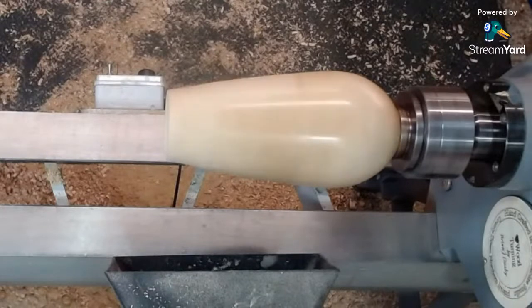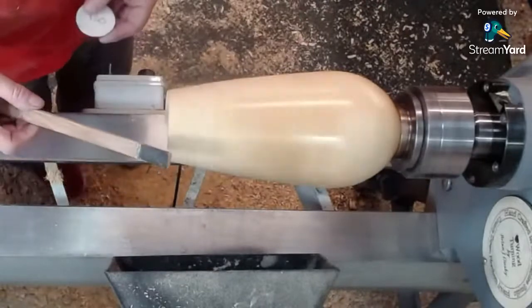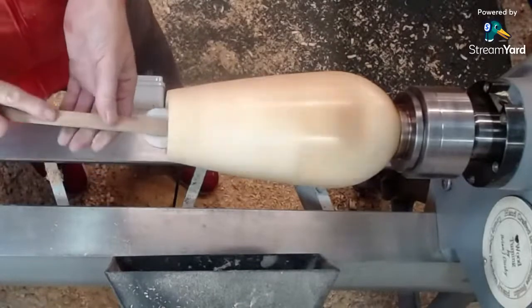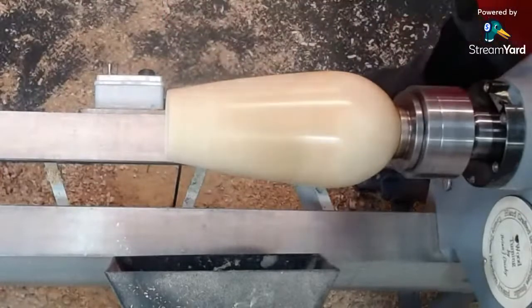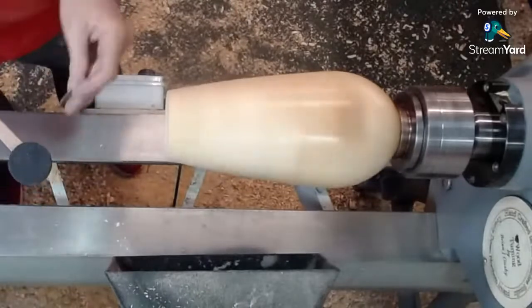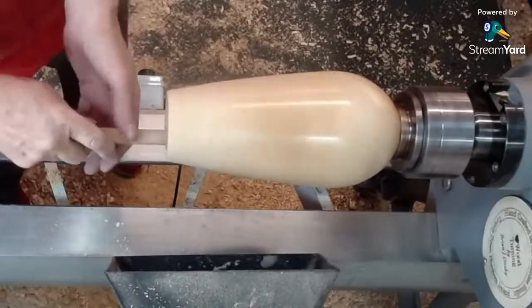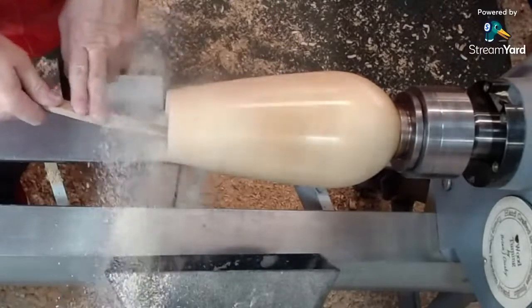I still think the best thing is a piece of dowel with a bit of Velcro stapled to the end, and then you just put a sanding pad on that. This is what Mike's talking about here. What I do is, instead of putting it straight on there, I put one of the little pads on first. I got one on mine permanently. Or even the red ones, the softer ones. Great bit of kit, that is. So there's two methods you could do. Oh, look at that. That's lovely.